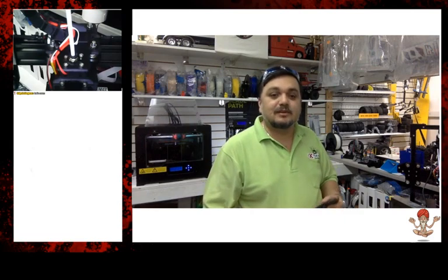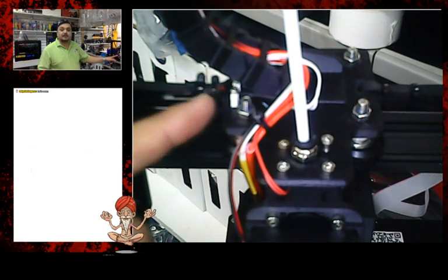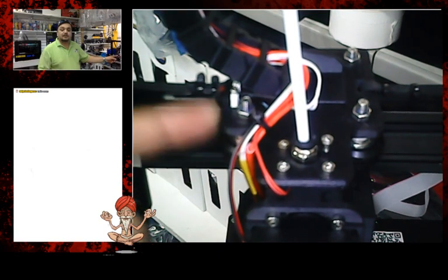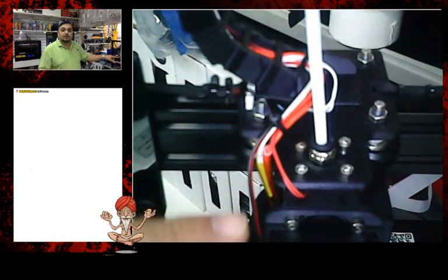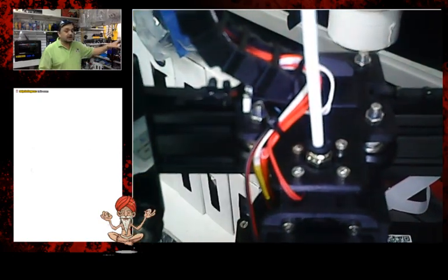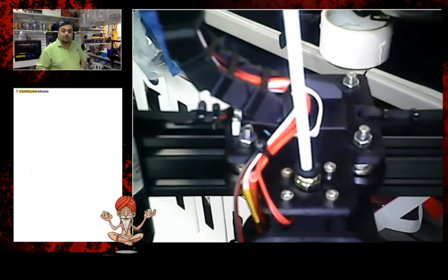Number one. I'm going to show you the upgrade right here — the X carriage. The X carriage has been overlooked for a while already. It seems pretty simple; it basically holds the bearings for the carriage to go left and right. But another big problem that Tevo has is that it has all the cables to worry about. I figured out a way to print the X carriage all in one piece — let me show you here.